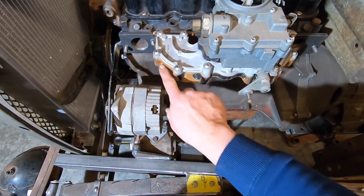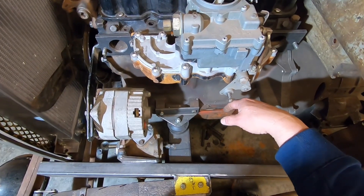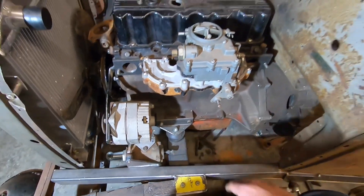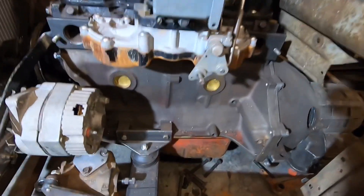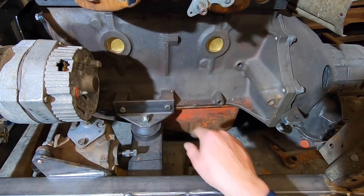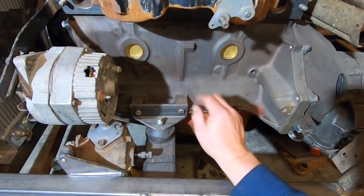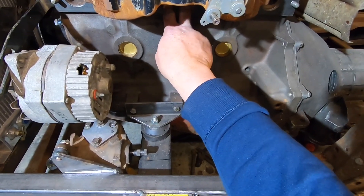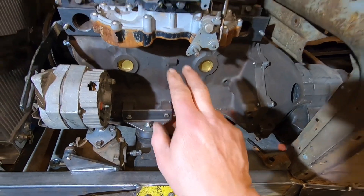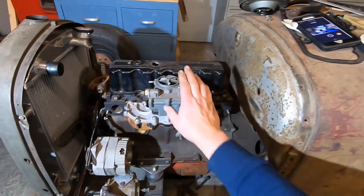After I got the head, I took the intake manifold off of it and I thought somewhere in that chunk of metal there's an intake manifold, so I just started cutting off the water jackets. This is what I was left with after cutting it down. The reason I decided this is the one I'm going to use is if you look right up underneath there, you can see it has an upsweep to it where the Clifford is kind of a big horseshoe bend. That upsweep gives you extra clearance for your exhaust — if you want to do lake-style headers, you can come straight out, whereas the Clifford would block those. So I think this is the one I'm going to use.